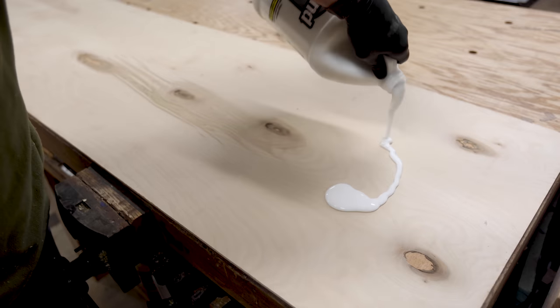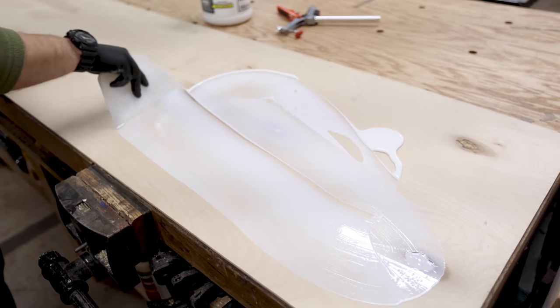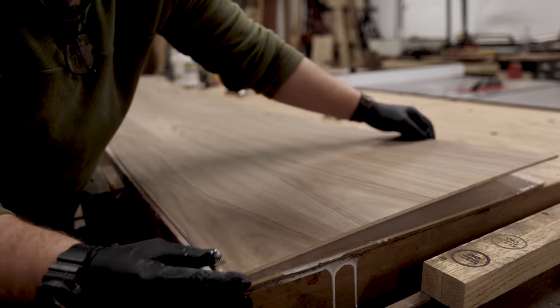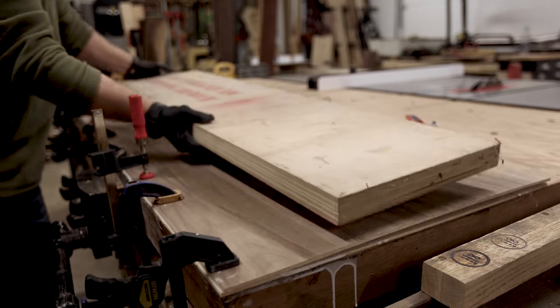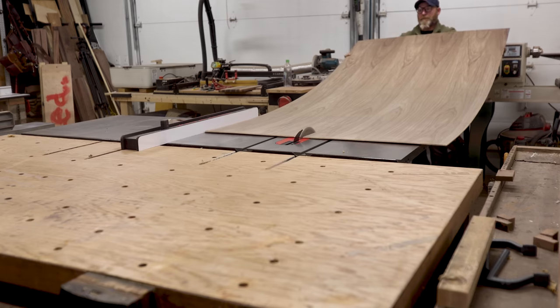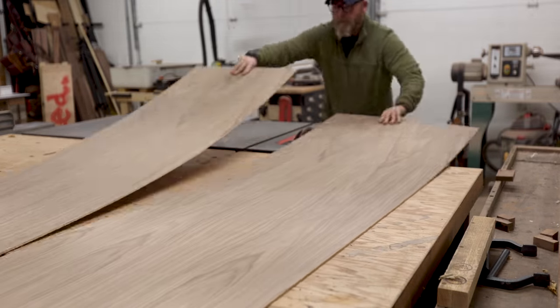And speaking of drawer bottoms, I ended up getting 2 sheets of 1/4-inch walnut plywood. I couldn't find any two-sided 1/2-inch walnut plywood by me, so a whole lot of glue and everything heavy in my shop, and we got ourselves 2-sided 1/2-inch walnut plywood. It's not ideal, but I was planning on putting a plywood backing on the larger cabinet either way, so this worked out pretty well.